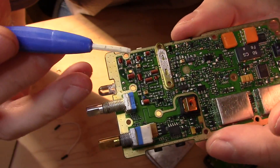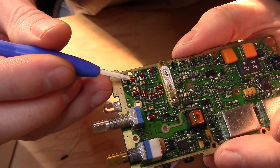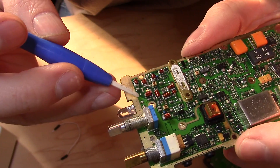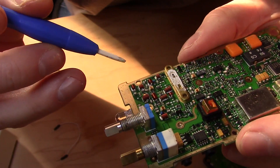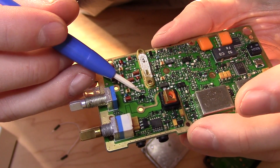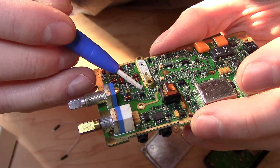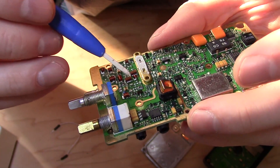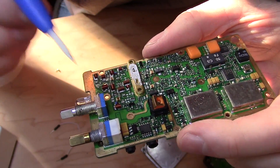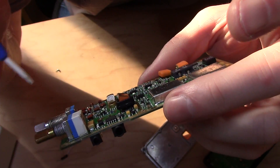One thing I wanted to mention just before I put this back together: I noticed over here in this section a lot of the actual components - I believe those are caps - are kind of just placed in there at an angle. They're not parallel with any other parts, especially right around this area, which I thought was interesting. The rest of the board is fairly straightforward. A couple of parts look like they've got a little bit of shift on them. It looks like there might be a zero ohm resistor here - maybe that's a test point they used where they drew a line underneath. That's typically what I do when I want to assemble a circuit, disconnect a section, and actually test it before connecting up.